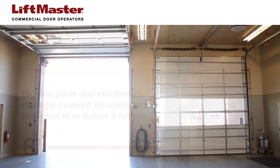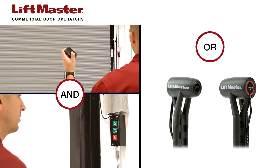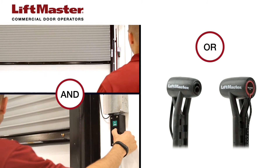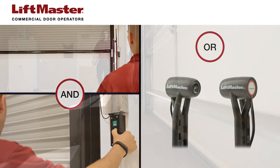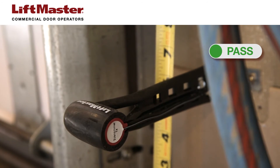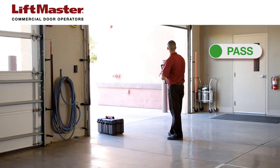Operators installed below 8 feet must have a cover or guard installed to protect and guard exposure to moving parts and electronics. In commercial door installations, the area where the door closes poses an entrapment risk. If the commercial door operator was manufactured on August 29, 2010 or later, it requires one of two options for protecting the entrapment risk: either limit remote controls to open the door only and configure the operator to require constant pressure to close, or provide an external entrapment protection device such as a monitored photoelectric sensor or a monitored edge sensor. If monitored photoelectric sensors are chosen, check that they are installed no more than six inches off the floor. You should also test the photoelectric sensors by placing an object that is taller than six inches in the path of the photoelectric beam between the sensors. The door should not move in the downward direction.